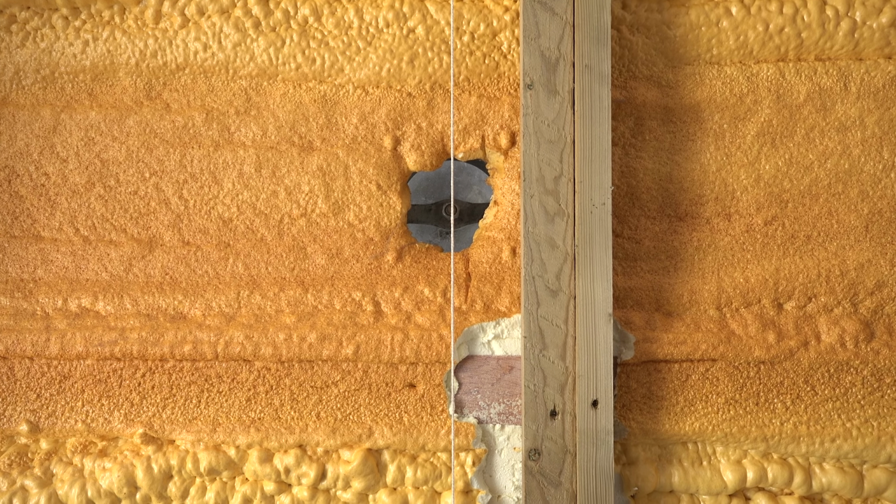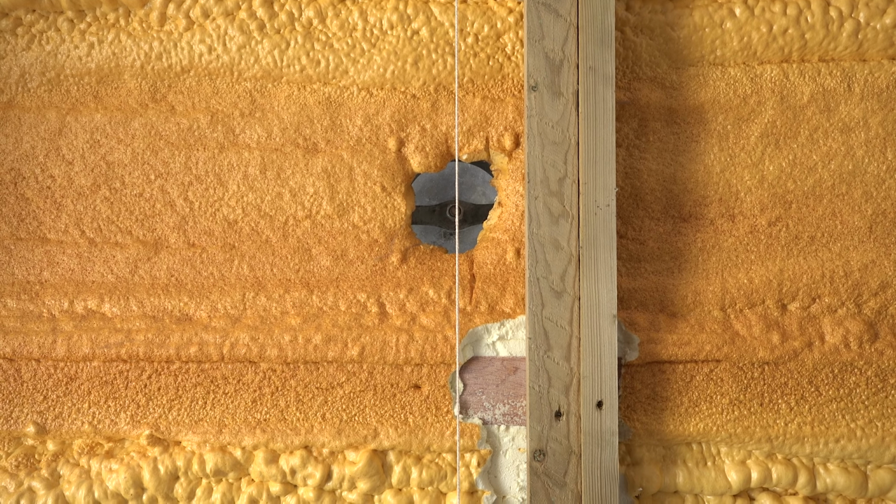And then it was about 9.5 centimetres either side was the edge of my next battens. So I've got 4 5 centimetre deep battens, which has allowed me to get away with not really cutting much foam back now, thank goodness. It's kept the thickness of the insulation, and it's added an air gap, and that's quite valuable, especially in a ceiling.